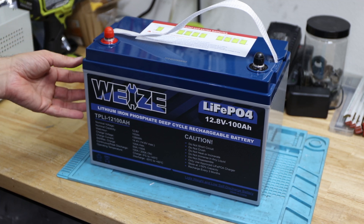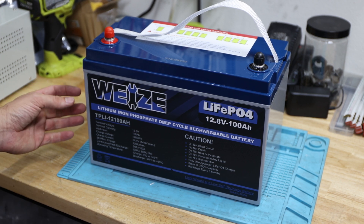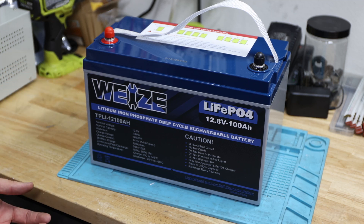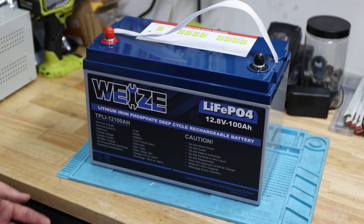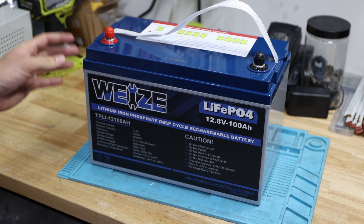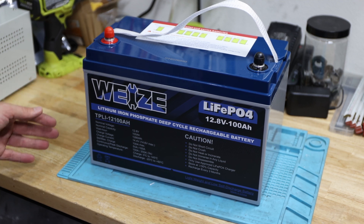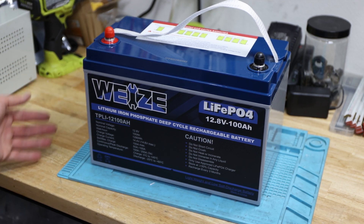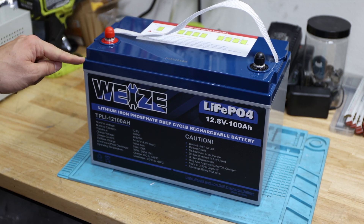My setup is made with some fuses, so the fuse did start smelling, which is pretty not cool. But I always like to fuse my stuff because when you have a battery which can push more out than you think, that can be dangerous — especially when you have smaller wires. So make sure when you anticipate only pulling 200 amps, size your wires and all components accordingly. Mine is not made for continuous over 250 amps, so that's why it's just not possible — sorry about that. But at least 200 amps for 10 seconds, and even more, is possible.